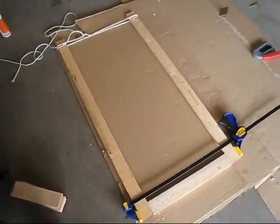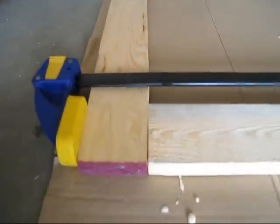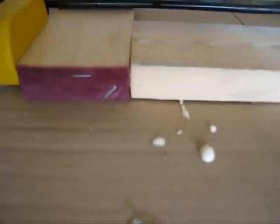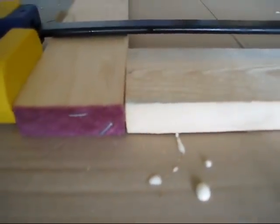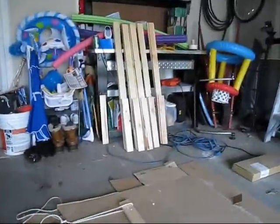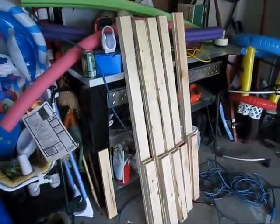What I'm doing is making some frames to stick on the back of that. I wanted a low-profile frame, so I'm just right now gluing some pieces of board together to make a rectangular frame. Over there we've got the remaining lumber for the other five frames that I'll be making. I've got some gluing done and what I'm gonna do is staple the boards together.